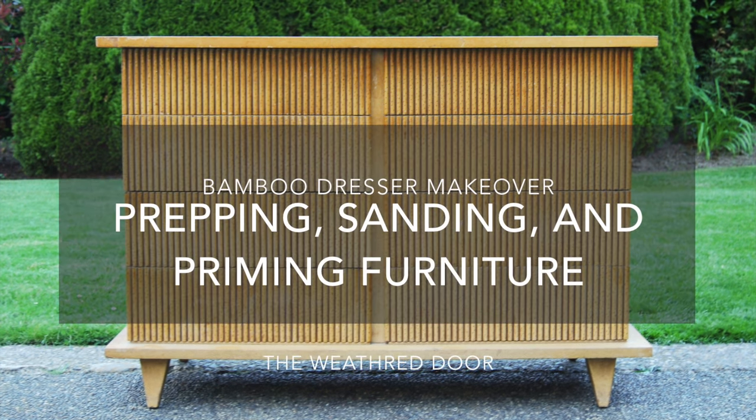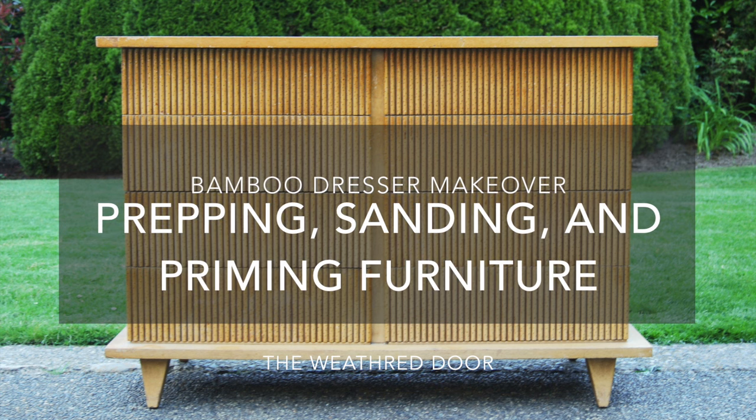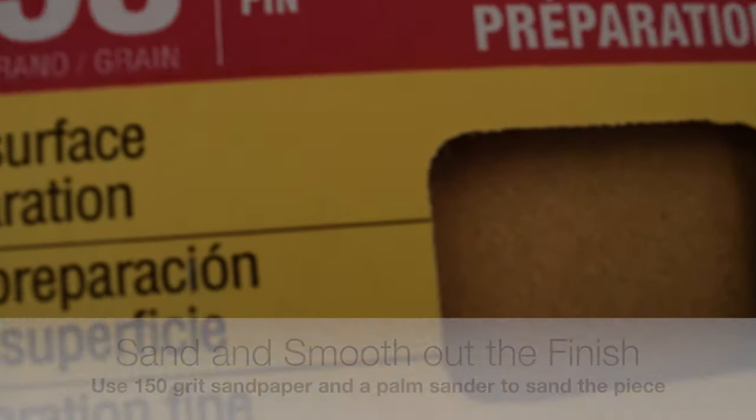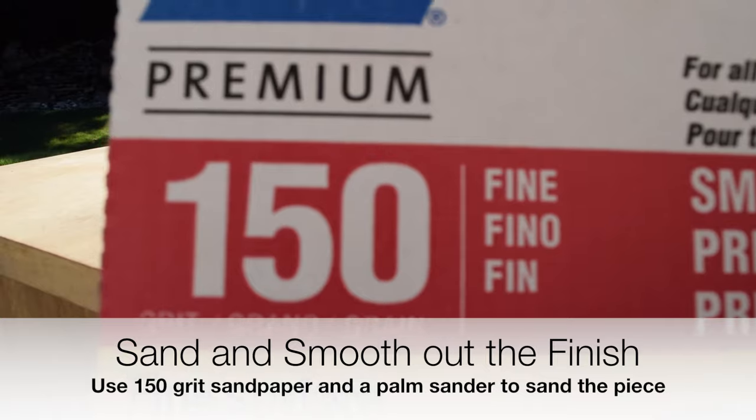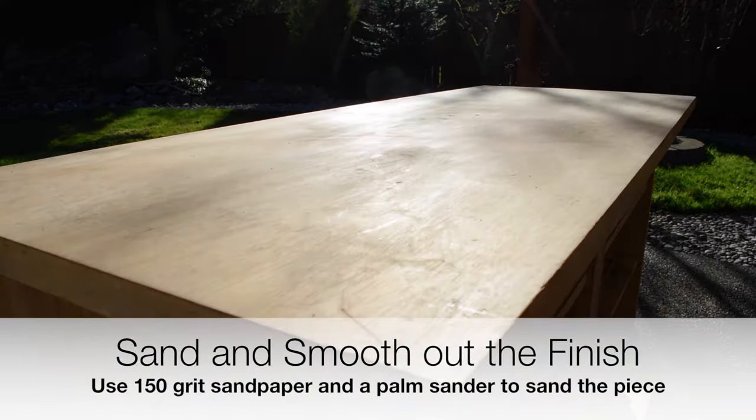This is the process I use for prepping, sanding, and priming furniture before I paint. I previously stripped this piece of its original worn finish. The video for that is linked below. Now I'm using 150 grit sandpaper with my electric palm sander to remove any leftover finish and smooth out the wood.